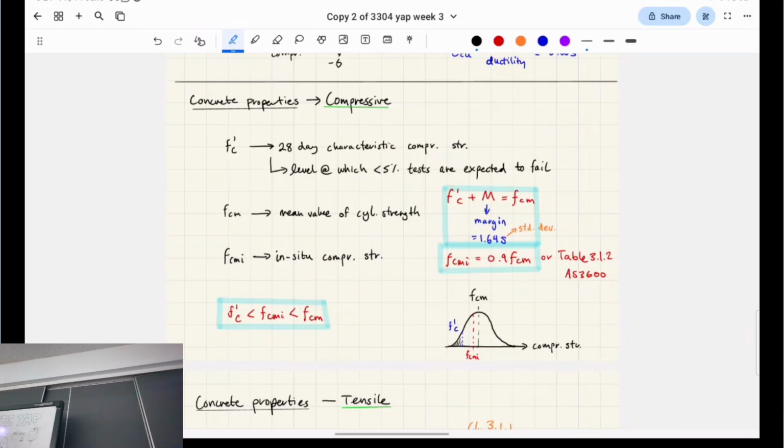So say we're just analyzing the compressive strength, and this is over time, right? Concrete looks like that, and it keeps plateauing. I like to write it like that, right? So here, this is 7 days. It keeps growing very quickly until 7 days. Here's like 28 days, and past that, there's a marginal difference in terms of how much stronger it's going to get, right? Does that make sense?